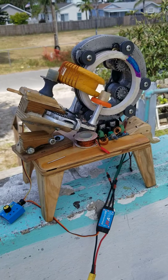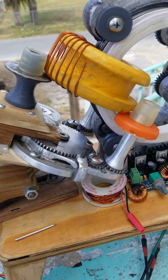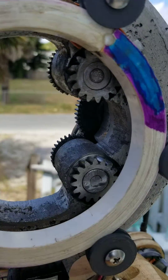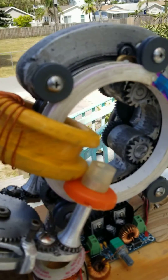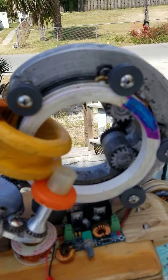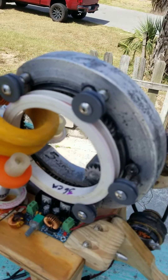This is the second iteration of this machine and it has been a true learning experience. As you can see there is a crown gear that goes around. The first iteration of this machine used to have a frame made out of wood, but pretty soon I found out that when the wood gets into humid air it expands and contracts and used to grab the gear.